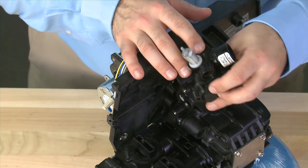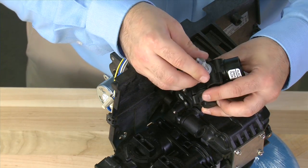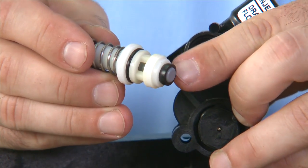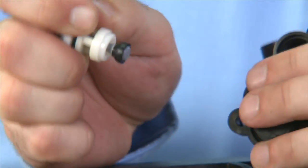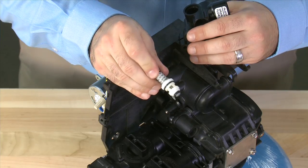As we move back over to the body, we can see where the brine valve is. This just pulls up and away from the body. We can check the O-ring as well as the sealing area to make sure there is no dirt or debris. We can press down on the spring and check all of the sealing area. If there is any damage, we would want to replace it.